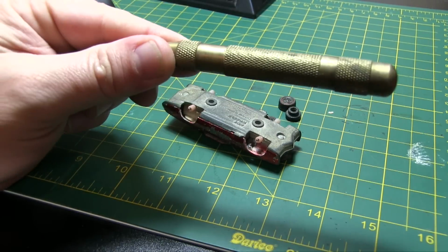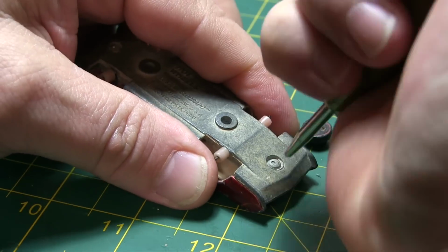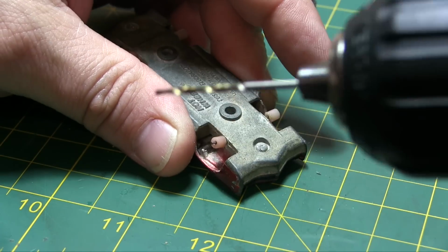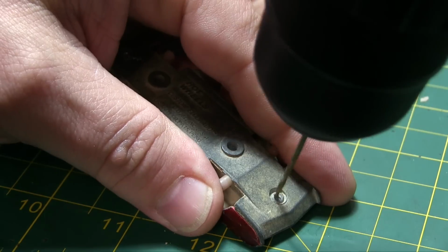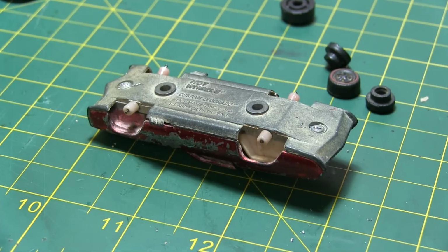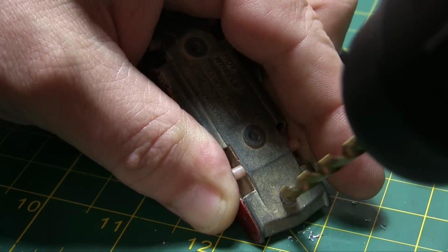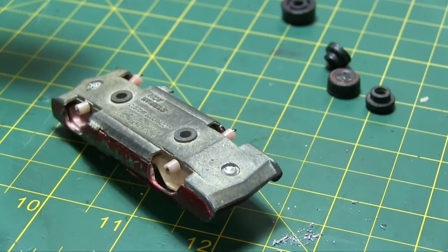Here I'm using a center punch for the rivets, going to start the hole there, just something to ride on. See that back when I didn't get it quite right. So here I'm taking a small drill bit. I think it's a 1.5 millimeter. I'll put a link in the description below, Amazon, where you can buy these parts and whatnot. But I'm just kind of getting it started. I'm going to take a larger drill bit here in a moment, right there, just so I can drill those rivets out, because I need to get the base separate from the actual casting itself. So just going kind of slow, drill a little bit, check it out, drill a little bit, check it out. Just keep on doing that.